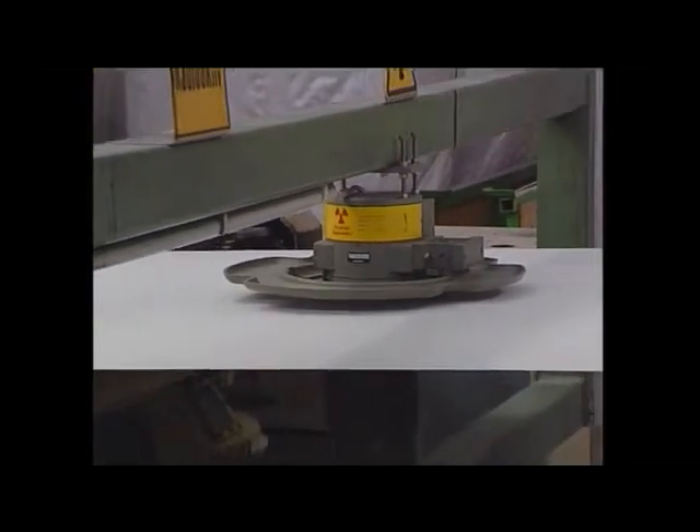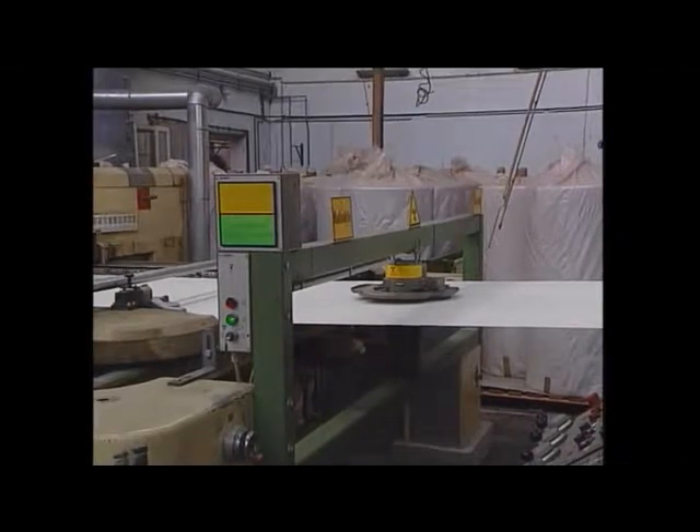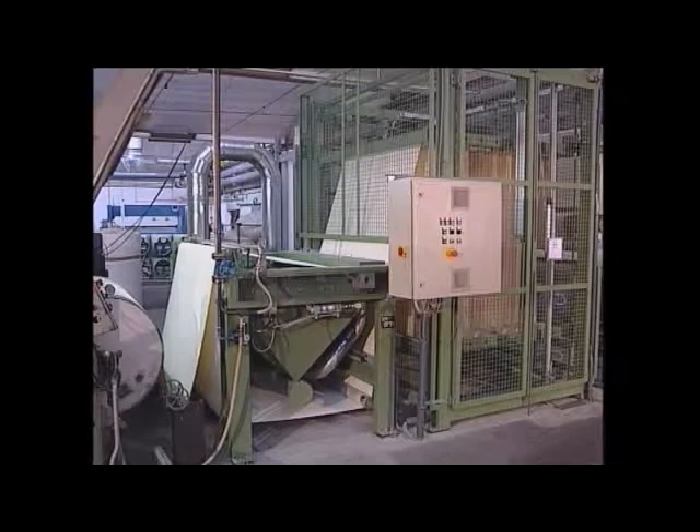This sensor measures the remaining humidity in the fabric. In a second dryer, the curing of the adhesive is carried out and a cooling roller then cools the fabric down. After which the fabric is cleaned with the help of beater bars and suction exhausts, and finally rolled up onto a material accumulator frame.